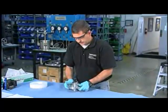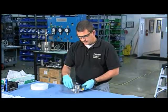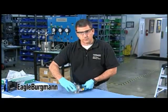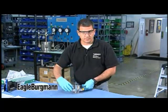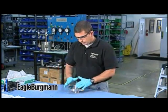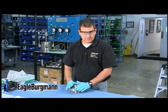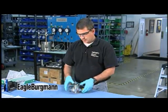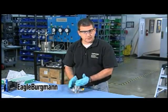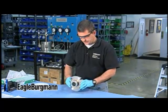That's usually the first thing I try to verify. For example, on this seal there's a vent, and that vent should be at top dead center. If a lot of the leakage is flowing in a certain direction, there's a good chance the seal was installed upside down. For seals that go on between bearings and pumps, they might be rotation-specific, so you want to know: is it the clockwise or counterclockwise seal, and do all the parts match up?